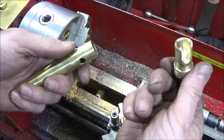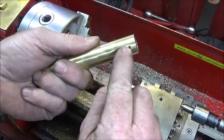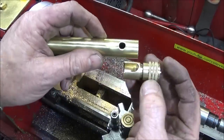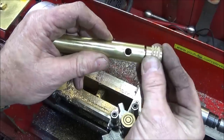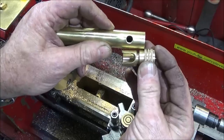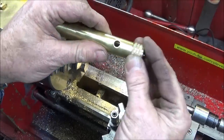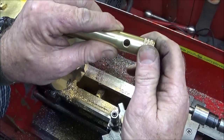So to finish off this part, I've deburred the holes for the roll pin to go in. And I've also drilled the exit hole for the pellets to come out, and all you still have to do with that one is put the shoulder up again against the end of the tube and see that the drill hole is going to be roughly in the centre of the U-groove. And when it's in operation, obviously you can see that it's going to close there all right,